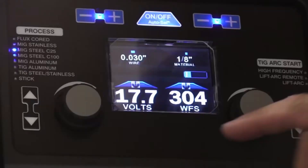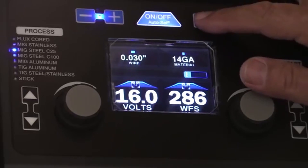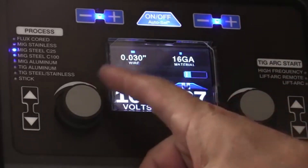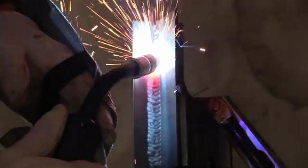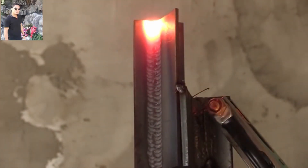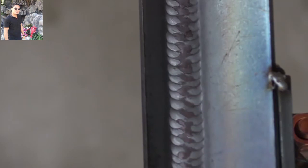I tried the same thing on vertical uphill on one-eighth inch thick steel — which I normally wouldn't do, but I just wanted to see if it would work. I bumped the settings down to the auto-set for 16 gauge and tweaked the voltage up just a tad, which seemed to smooth things out. This is the second pass of a double-pass weld on 1/8" steel — a nice smooth arc, easy to control the puddle. Obviously this is way more weld than you need on eighth inch material, but I think this could be a way for schools to control their budget by starting on eighth inch to get the technique down, then going to quarter inch just to learn the hotter settings.